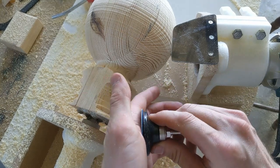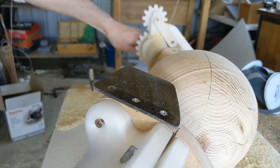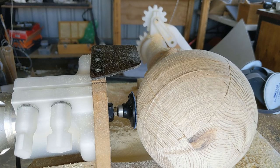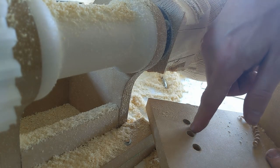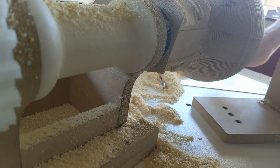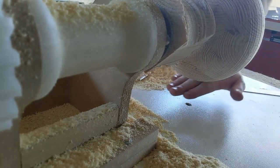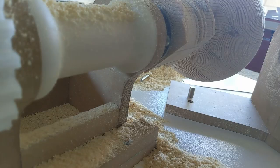I'm not sure if I'm going to be able to sand this nicely with the 40mm offset, or whether I'll have to offset it more or less. Let's find out together. The first attempt ended in disaster - I gouged it out because I left it in one spot too long. Turns out the soft rubber's not really helpful. I also decided that the 40mm offset wasn't working. There are our three holes - one on the center, one a little bit off, and the original one at 40mm. So I think what we'll do is try the one a little bit off first. Oh my goodness, that's tight. There she goes. Very good. Now we're ready to try this again.